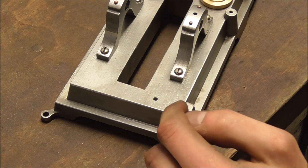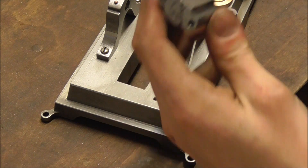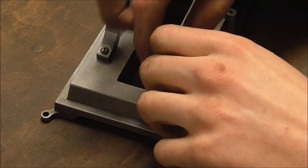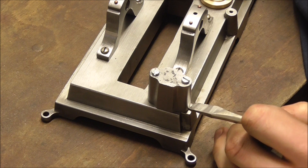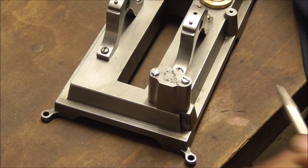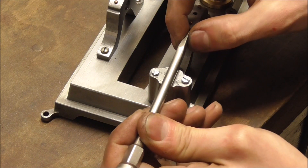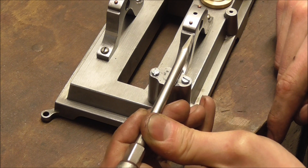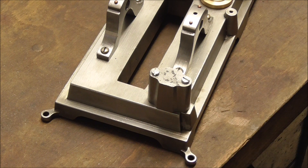Apparently I drilled these holes wrong. They line up alright with the holes I drilled into this piece here, but when I bolt this down you can see the contour isn't lining up because the whole block is shifted too far to the left. The water pump will go in here, and if we check that, it's going to hit right into the bearing block when it's supposed to go just past it. I seem to have gotten the measurement wrong by about three millimeters.